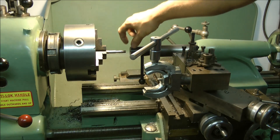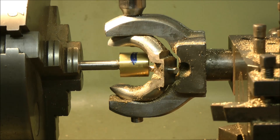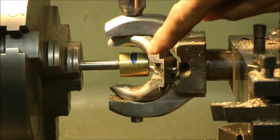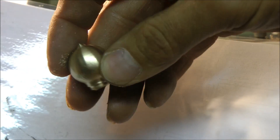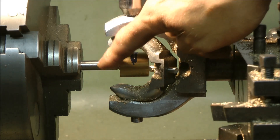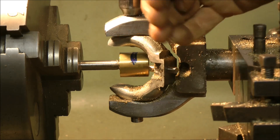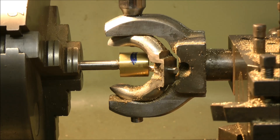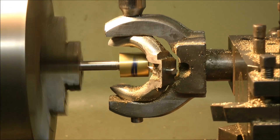I'll make a little bit of brass now for the end of that. I'm ready to turn a brass ball for the first go, but I'll do that tomorrow — it's time for my tea and I'm having a spag bol, so I'm off. Ball turning attachment test two. I've added a pocket there so that part doesn't catch the shaft, and I've also added a pocket there so I can have a longer tool steel. On the first attempt I got a lot of chatter as you can see on the rear of the sphere — the whole unit was bouncing. I don't know if it was the mandrel wasn't thick enough or this is just no good. Probably no good. So I'll give it another go — I've altered the cutting tool steel as well, it's got more of a radius on it. All I can do is give it a go.